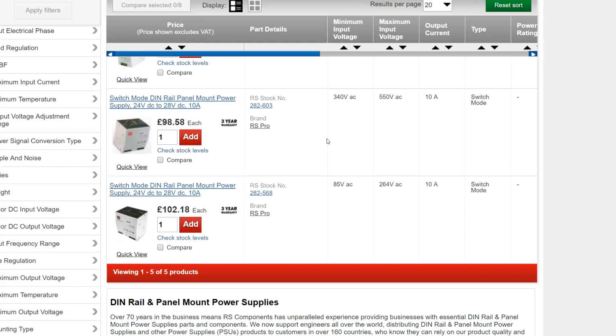You can, as we've shown you, configure it to monitor different things and to trip on different levels and everything else. So I would suggest that if you really have those more sensitive systems where you want to have the elevated monitoring, preventative maintenance capabilities and things like that, Phoenix Contact definitely looks like a power supply that you should have a look at. I haven't seen any other power supplies so far that have the ability to program its parameters through an NFC smart device. There may be some that have network connections or RS-485 and things like that. I just have not had them in my hands to review yet.